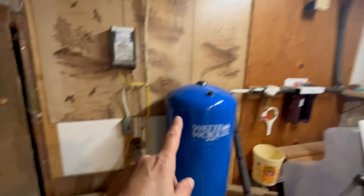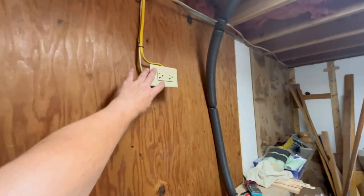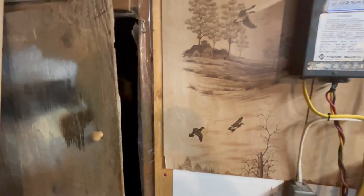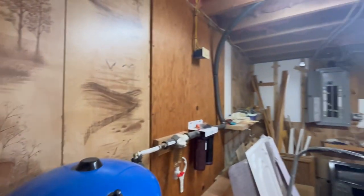We just got the cover on, so now we're gonna come over here, turn the switch — light is working in there. We're gonna hit that test button — no light. Okay, reset — and we got light! Alright, electrical parts done. Like I said before, if you're uncomfortable with this or you have no idea what you're doing, consult a professional or hire an electrician, even just doing a receptacle like this, just so you can be safe. And yes, this is a GFCI especially when we're dealing with all the water that is going to be right here below it — we want to make sure that we're safe.